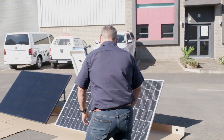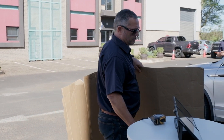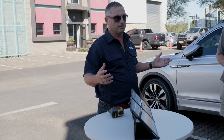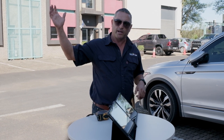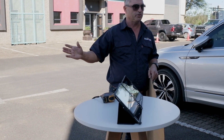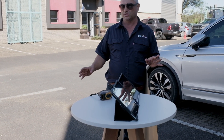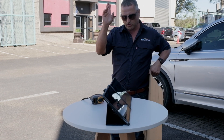I've played around with some shading and some funny things happened. Yesterday we had some cloud cover, and shading is very difficult to simulate — it's not a piece of cardboard hanging on your panel. But a cloud came past and the IKO panel kept producing; the load was 140 watts and it kept producing 140 watts. The other panel just died, completely. As the cloud moved away, the other panel woke up.